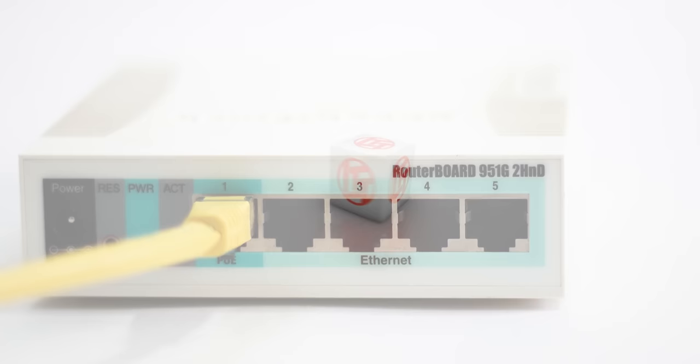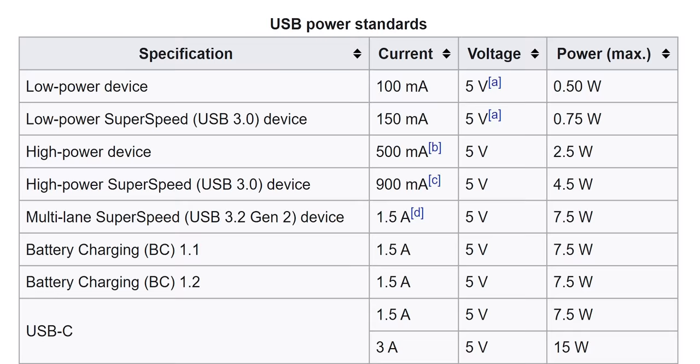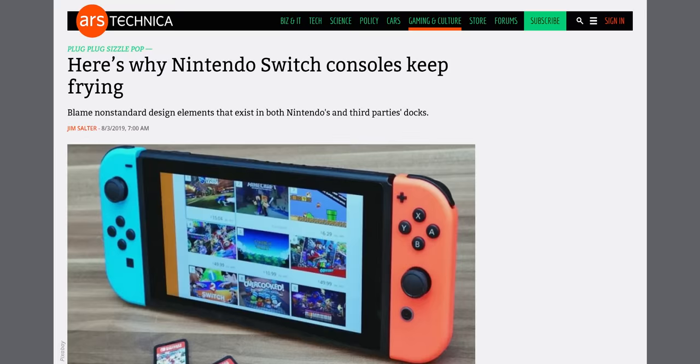Garage door sensors too. USB-C is understandably confusing. There are multiple standards for data, multiple standards for power, cross compatibility that works except when it doesn't, except when it does — but unofficially. And we endure this because ultimately it's still a lot better than the alternative. The focus of today's video, USB PD or power delivery, is just such a perfect example of this. Because some of its features are optional, it's common to run into products that support USB PD but not all of USB PD. More on that later.